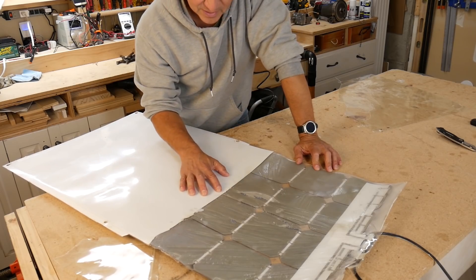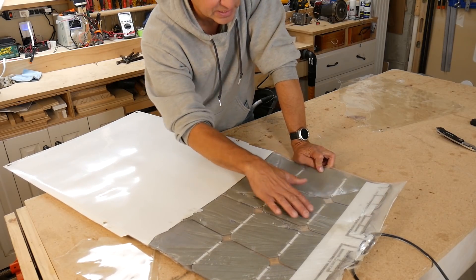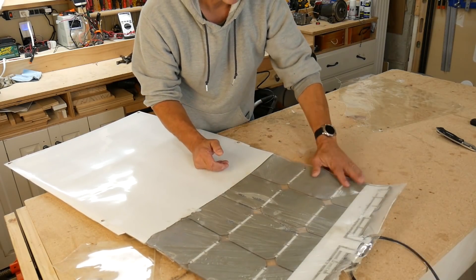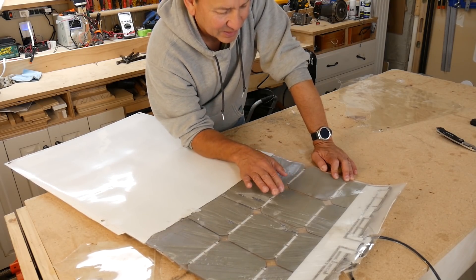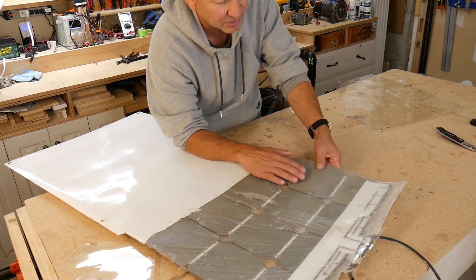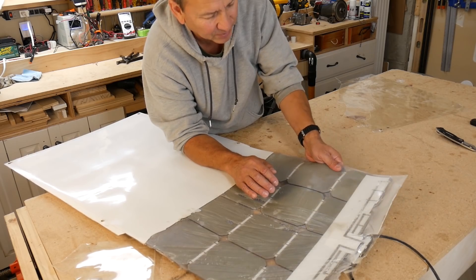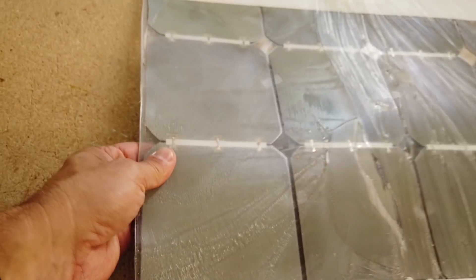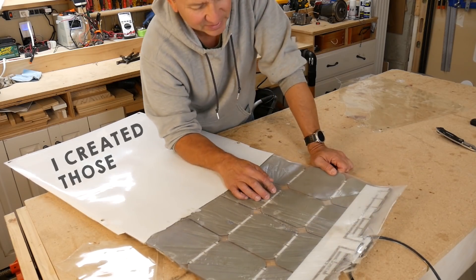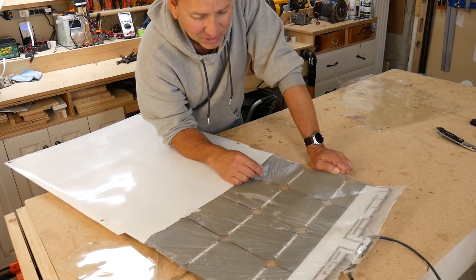That's basically how this solar panel is wired. These are back-contact cells, so you don't see any tabbing strips on the front — all you see is this dark-colored monocrystalline-looking cell. The difference between these cells and the SunPower cells I have now is that these still feel pretty flimsy even though they're back-contact. The SunPower ones have a solid copper backing which gives them a lot more protection from breakage or cracking. When I was taking this off, I could tell there were some little micro-cracks in here — they're hard to see but they're definitely there.